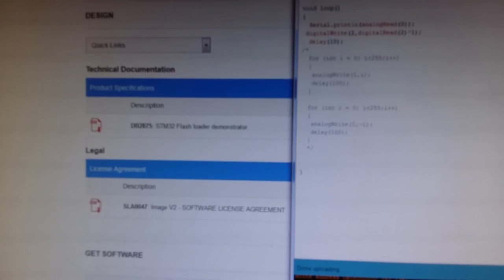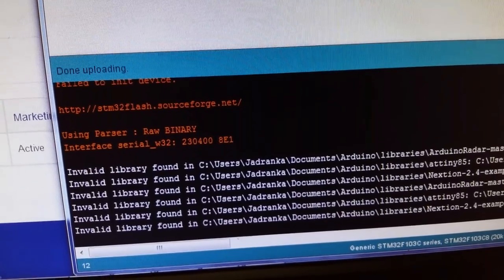Yes, I wanted to point out, now you have programmed your first program. So far, so good. Now you make some change, let's say you have a delay of 5 milliseconds, okay. And you click upload, and it will complain. Why is that? Because the old program is running, and this FTDI has no ability to reset this chip. So you should reset the chip, but I forgot to point out the boot jumper.